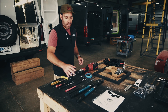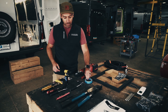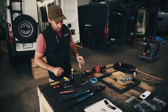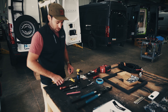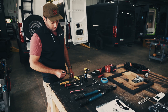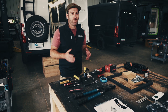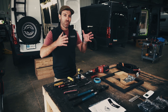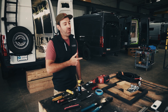To do this swap over, we've got some crimping tools, power crimper here — one of my favorites — utility knife, some masking tape, an allen key for removing the old unit, some heat shrink, some butt splices to wire in the new unit, wire cutters to cut out the old unit, a couple sockets, torch for the heat shrink, and then just an open-end box wrench. This is a relatively simple install since we're swapping a 12-volt unit for another 12-volt unit. They both use a 14 by 14 opening, so this unit is literally just going to drop right in once we get the old one pulled out. Let's start to work on removing that old unit and move over to the van.